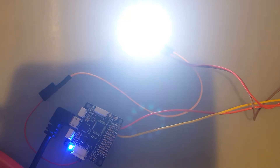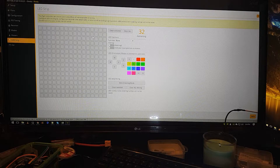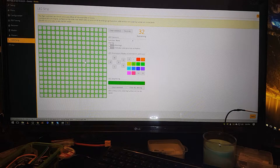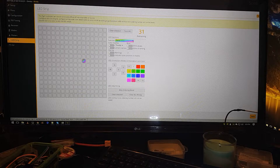Now let's hop back into Betaflight and change the first LED to green. We have a new tab called LED Strip - click on that and you get this grid. It looks a bit confusing but it's really not. We need to figure out the first LED, so first we tell it the wiring order. Go into wire ordering mode and click on any square - that's zero. In programming languages the first thing is usually zero, so that's one for us. Pop out of wiring mode, click it, go to Functions, set it to Color, make it green, and save.